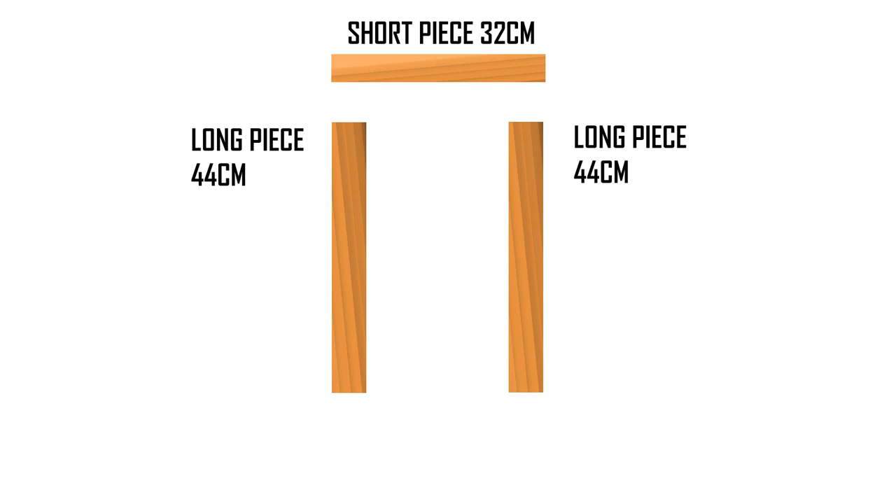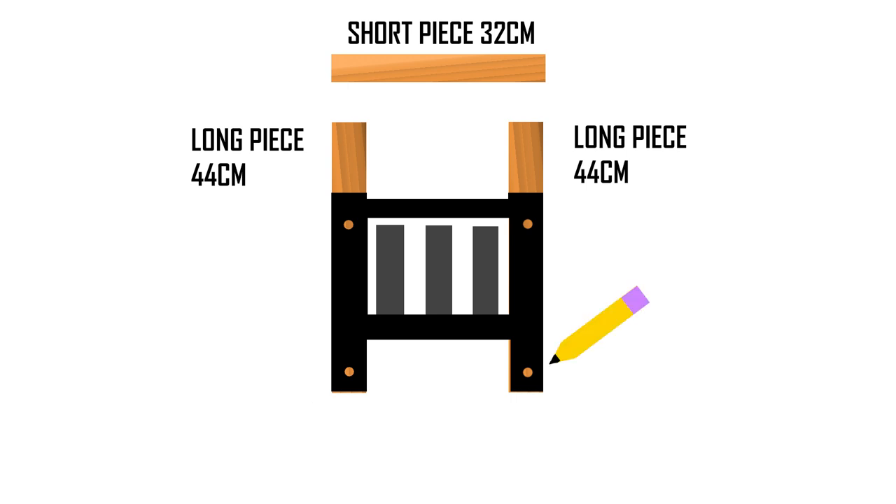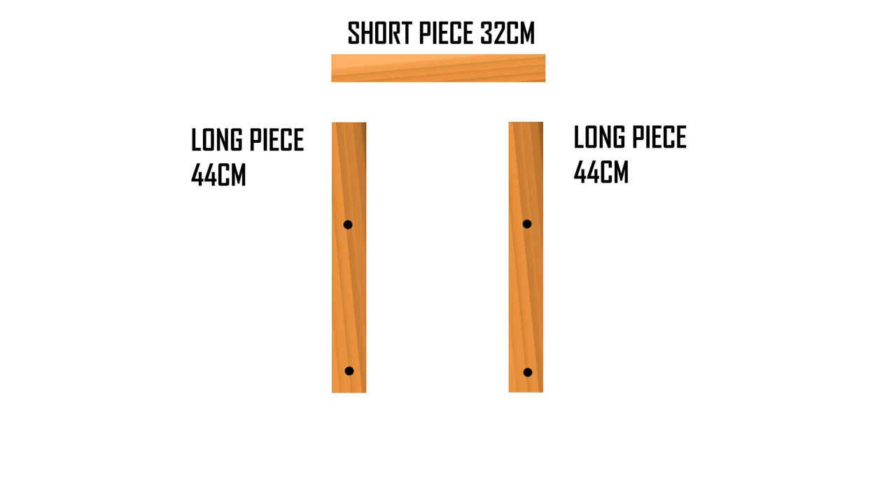The first thing you'll want to do is get your two long pieces and place your Club Sport V3 pedals on the wood, just like this. Make sure the front foot of your Club Sport pedals is level with the end face of the wood at the front end. Line up the two long pieces as straight as possible down the length of the Club Sport frame so that they line up like a ladder. Then, as best you can without disturbing where everything is, mark where the four holes are — this step probably affects the quality of your build more than any other.